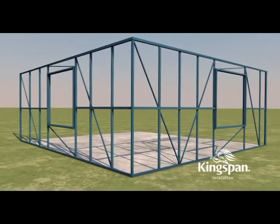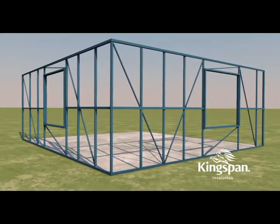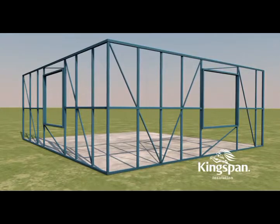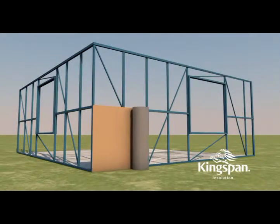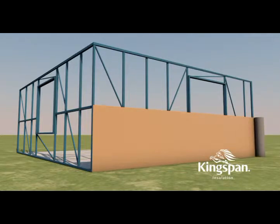For installations with fibro-cement claddings that are less than 10mm in thickness, the counter-batten method is the preferred method. Fix Aircell loosely to the outside of the frame using wafer head screws, tape or otherwise, while leaving flexibility for it to be dished into the wall cavity between the studs.